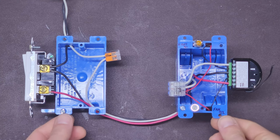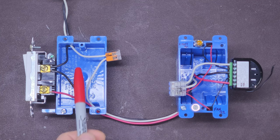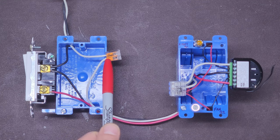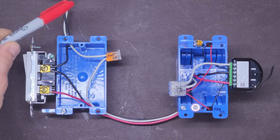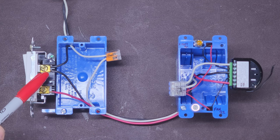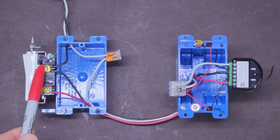I wanted to provide a simplified overview of how the module is connected. The junction box on the left is an ungrounded equivalent of your standard fan switch circuit. The white neutral and black line come into the box. This is a standard switch, so the neutral goes directly to the box on the right, simulating your fan's wiring area. In my home, the line voltage was also passed to the fan so it can always be turned on by its pull switch. The same line is also connected to the switch, which passes the red switched wire to the fan light. This is the switch I removed in my installation, tying the hot and switched output together.